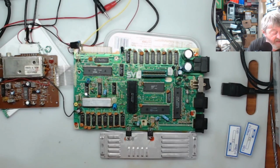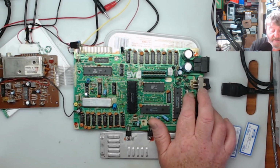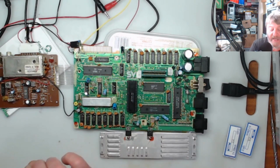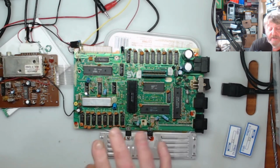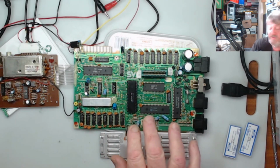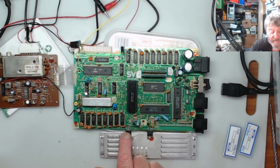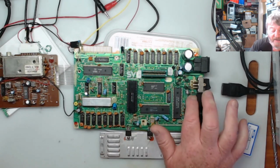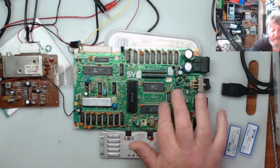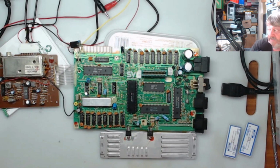Some people will find that they will have to check their fuses. Some of the early Spectra videos only had like a half or a 1 amp fuse, and any more than the cassette deck plugged into it, the draw, because if you read the documentation, it says it only puts out around 100 or 200 milliamps on 12 volt. So if this 3 amp fuse is actually running the 12 volt side of the system, this can pull 1.5 amps. So if it's only putting out a couple of 100 milliamps at the most, why have they got a 3 amp fuse in there if it's only running the 12 volt side? Considering when this was blowing, I still had 5 volts. I don't know. I digress.